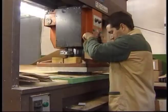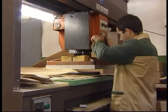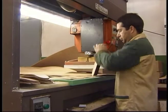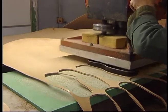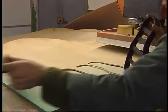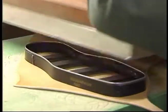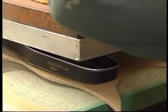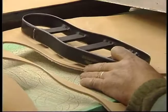Preparation of the sole: to cut soles. In this construction type, the material used for the manufacture of the soles is usually leather. Due to the hardness of the leather, clicking presses with turning arm are used in this cutting. However, it is not possible to cut several layers simultaneously as is usual with these equipments, since as it is a natural material it presents defects that have to be detected during the cutting process.